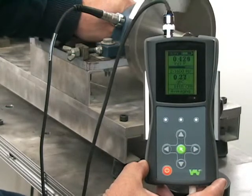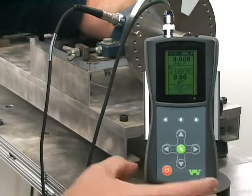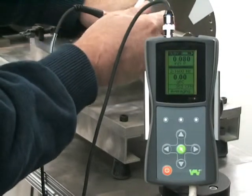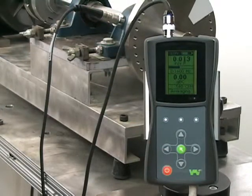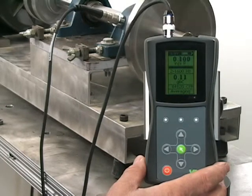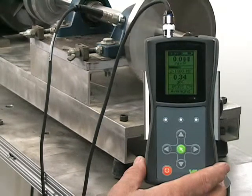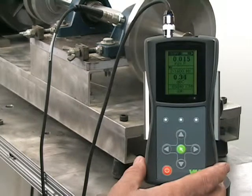We will now do a little repair work. We showed you that most, if not all, the vibration was unbalanced that we created, so let's remove the problem and restart the machine. Watch and listen as the machine comes up to speed — the vibration level has dropped a lot. It is now reading at 0.014 inches per second peak.